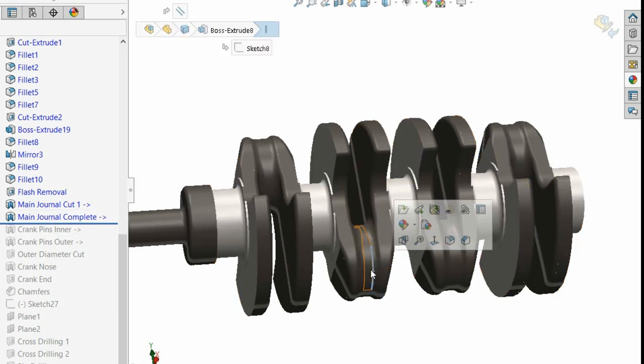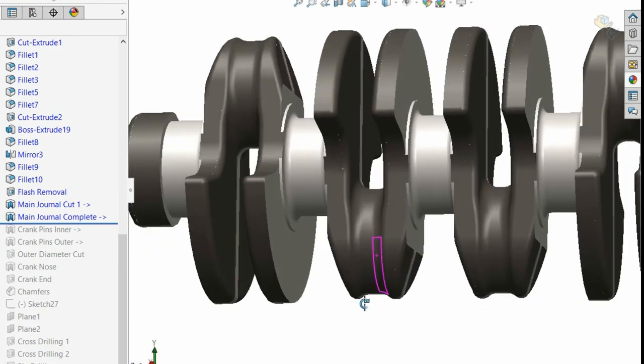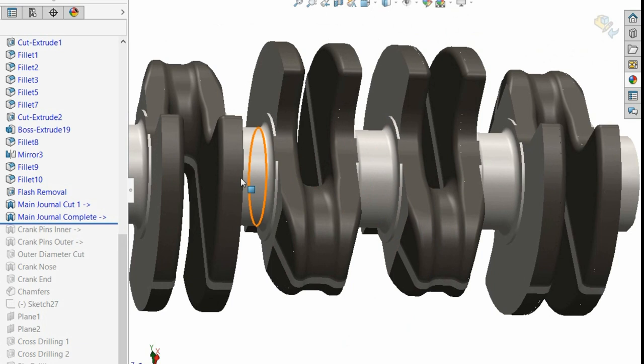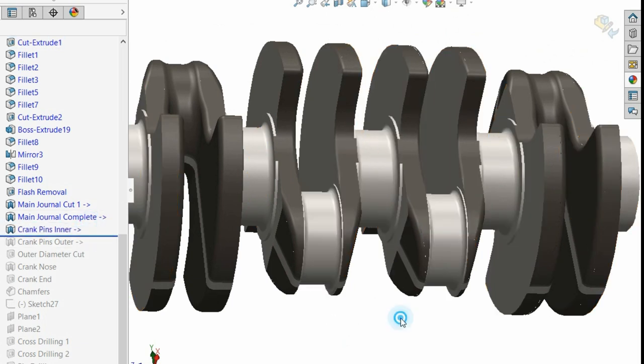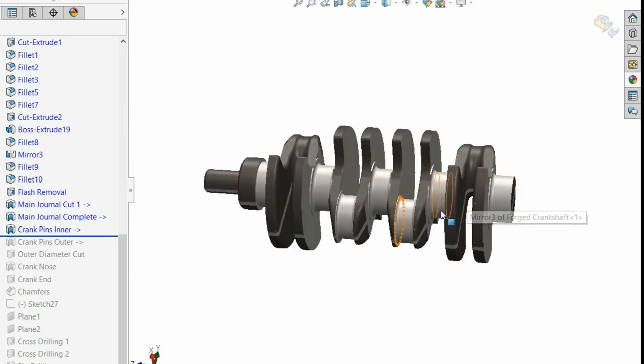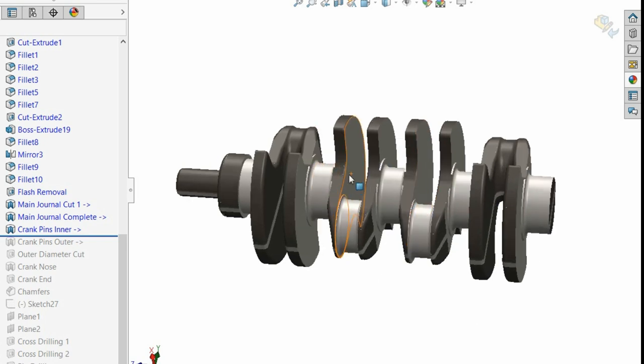So the crank pins are here. You can see how they're just blobby and rough and all that kind of jazz. And when we cut into that, like so, you can see now we've cut the main journals. Now, when we do this, we can't spin this on centre. A lot of CNC machines can move both, or the head moves.